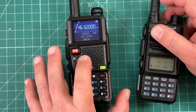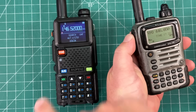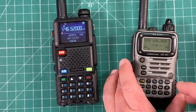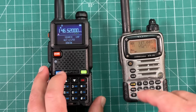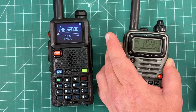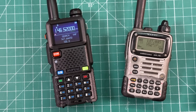I've been racking my brain trying to figure out a useful reason for this button. Maybe you're with some friends, your buddy's got a radio with the repeater already programmed in — he keys up, you find it, hit the green button, save it to a new memory channel. But that's not how it works, because when you transmit you're on a different frequency than what the repeater listens to. So you still have to program it. And just for giggles — let's go to VFO memory, go to Lake Placid in Florida. That's a two-meter repeater. We'll key up on VHF. Notice I'm on 147.645, but this picks up 147.6445 — it's not even accurate. It did get the tone, but if you transmit you're going to be off frequency. So it's just bad.